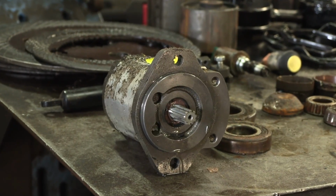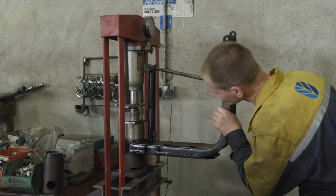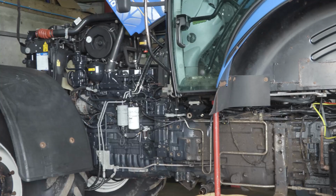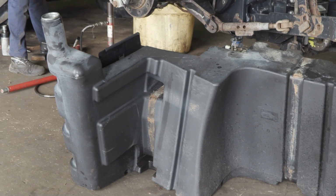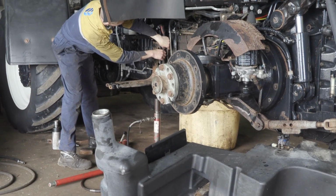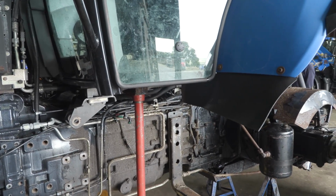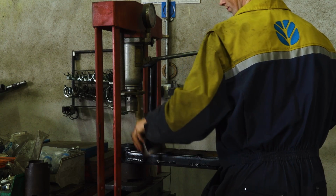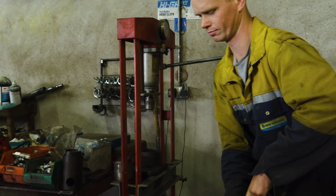And then, at that stage, you had her ready for a couple of cosmetic changes, and functional changes. Cab bushings. Cab bushings, yeah. And that's a big thing. There's a wee bit of technical effort involved in that, the way you lift the cab. Weight of the cab, diesel tanks, all that has to be taken into account. There's a lot of stripping at it. And then it's the pressure involved in pushing out the bushings and setting the new ones in. They need to be pressed.